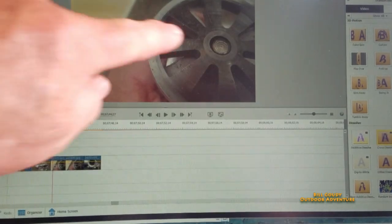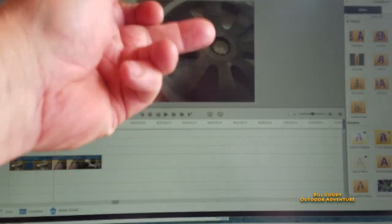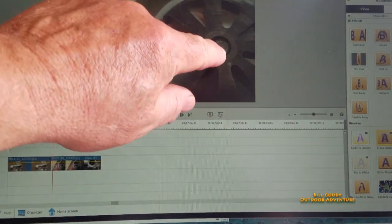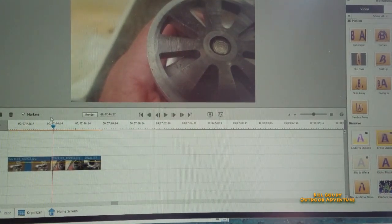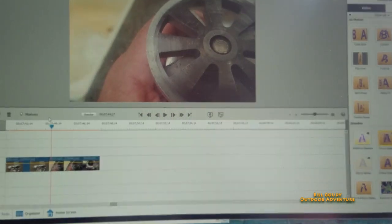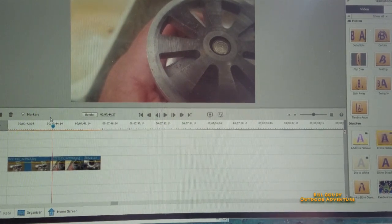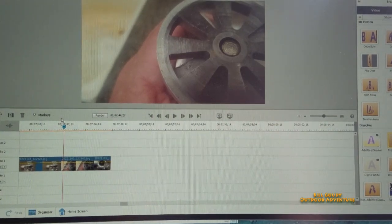I suspicion that this part right here, that this is the cutting blade is underneath. This is the auger. The top of the auger has a pin that sticks out, and I suspicion that that is wore down. Also, I think that the nylon bushing is wore out in the back. That doesn't allow the blade to push against this plate properly. And then with this wobble and that bushing with no pressure, it causes the sinew not to cut. It binds up and it doesn't grind proper. That's my problem. I got to get it fixed.